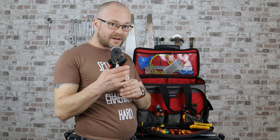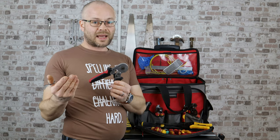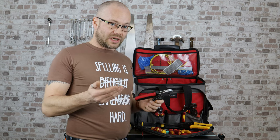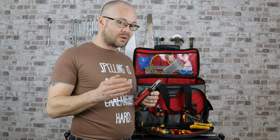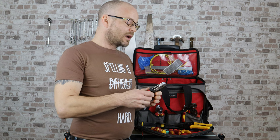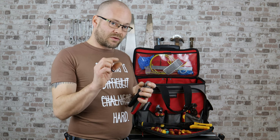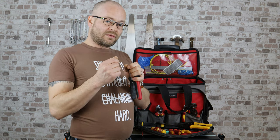And this is for my ferrules. If you're using flexible cable — if you're wiring a caravan or a shepherd's hut, for example — all of those things should be wired in flexible cable. It's now recommended by BS7671 that you put a ferrule on the end of all flexible cables to stop any burrs.